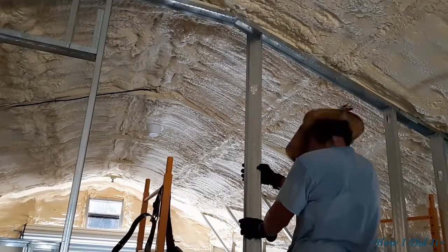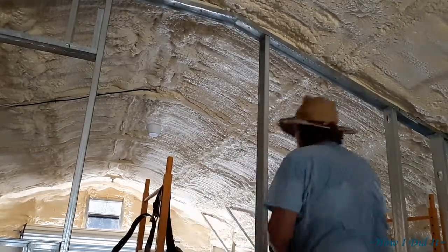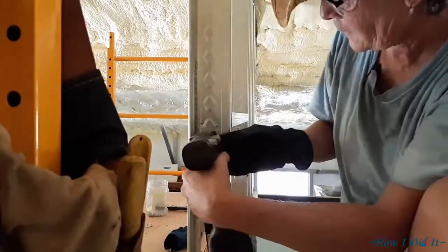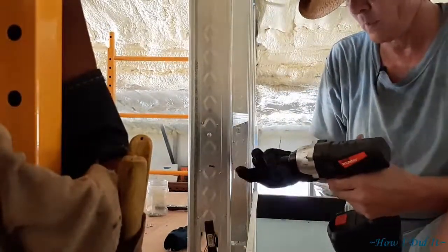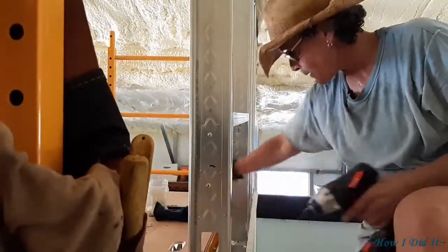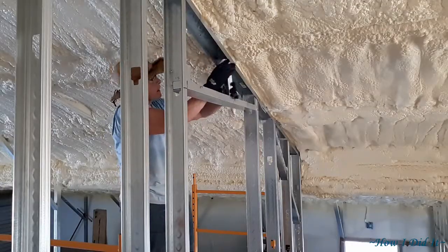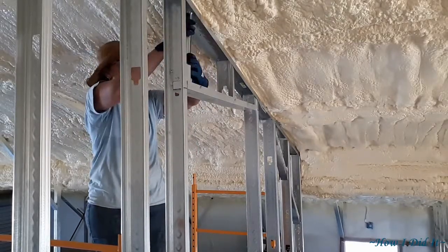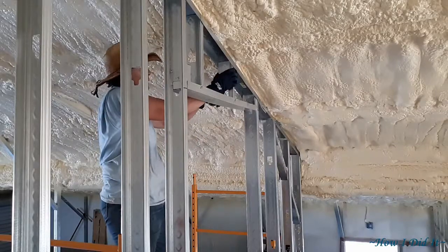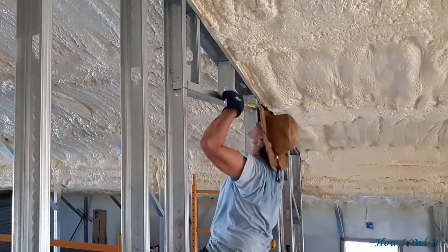Alright, going ahead and we're setting the studs. The studs set up here are 16 on center, just like conventional framing, and then here I'm just putting in the opening for my 36 by 36 inch sideways slide window. Put them up special order, put it in at Lowe's. It was kind of nice because you got 6 months same as cash, so instead of me putting my cash out of my pocket, I keep my cash in my bank account, make them the payment.